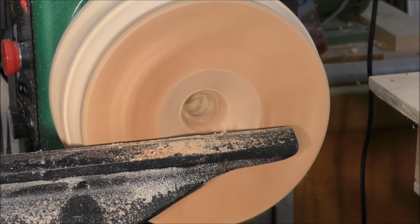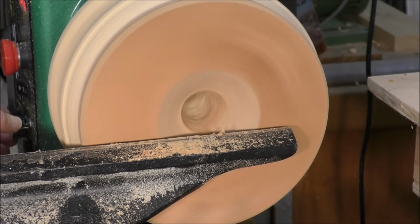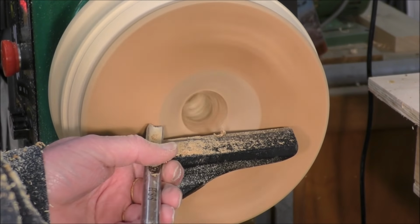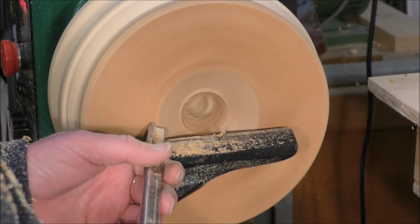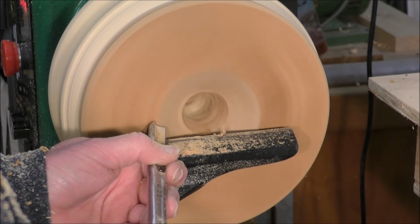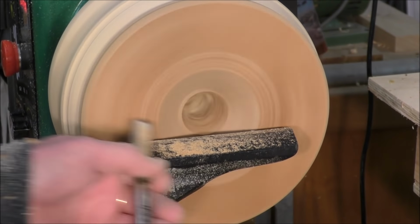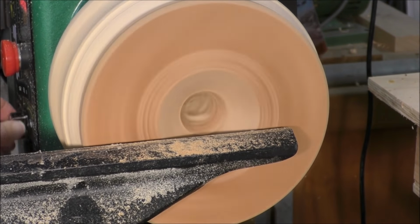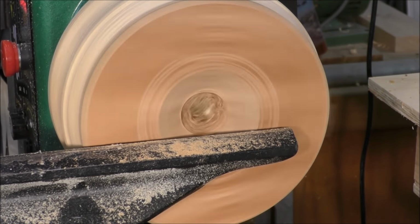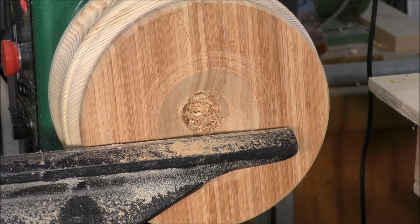so what you can also do, I don't know whether you noticed, let me just fire the lathe up again. Using this method, you'll notice as the tool just starts to apply, it'll kick it back this way. Watch. Oh. See, naturally kicks it back out. So that can ruin your bowl, if you sort of don't keep an eye on that sort of thing.